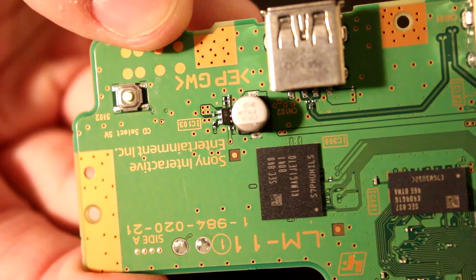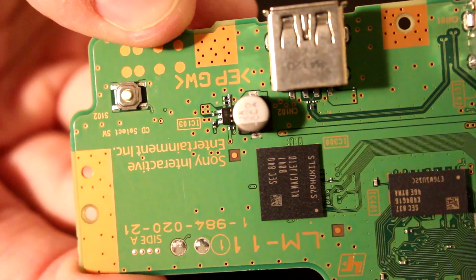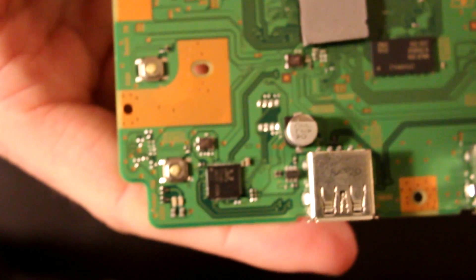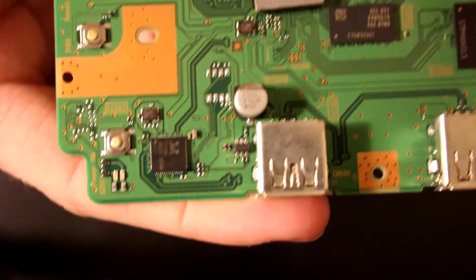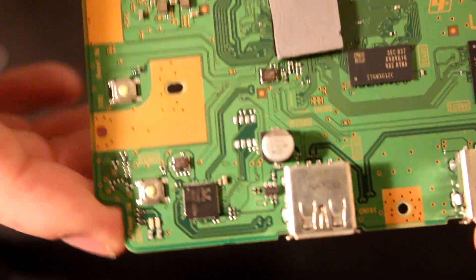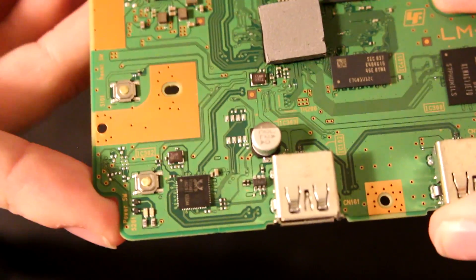There are the two points bridged. At the end we'll do a test to make sure it works, but those look pretty good. Now I'm going to show you how to do the conductive ink method. We're going to do the same thing on the other two resistors — here and here — on this side of the resistors. If I have more detailed pictures on the Mod My Classic wiki, I'll link those in the description. Let's switch to the overhead cam and do the conductive ink method.